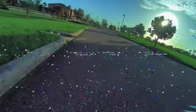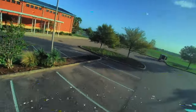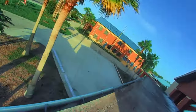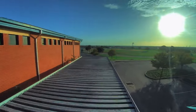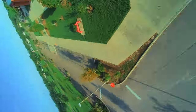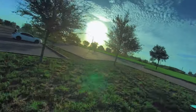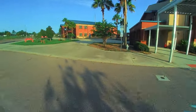I was just talking to my buddy Dave yesterday about that. There was a spot that we used to fly, and there was a particular place where he would get really bad signal. It wasn't that it was very far, or that there was that much obstruction. It was just the way it was. He couldn't go there with his DJI setup. So it's crazy. This stuff is all RF. It's not magic. Digital and analog, they all are over RF, so there's tons of noise. And noise affects things differently depending on how the system sends the data, whether it resends it, how it interpolates it, how it uses its antennas, and whatnot.